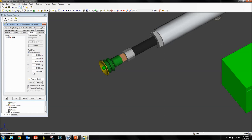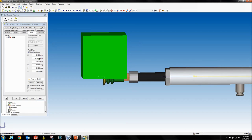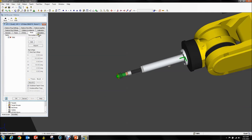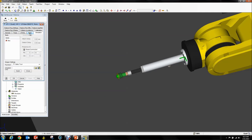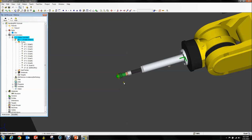Then the next thing is we want to add our box to the gripper and edit our offset. We have to add a little bit of rotation to get it square. Make sure your Z axis points into your tool. Some of you might already do that. Some of you might have the convention of Z pointing out — for bin picking, unfortunately, you have to point it into the tool to make it work properly.